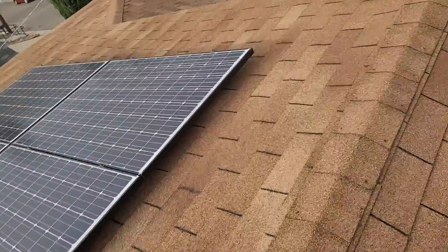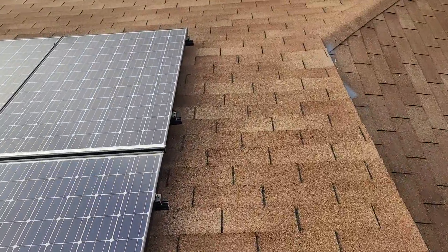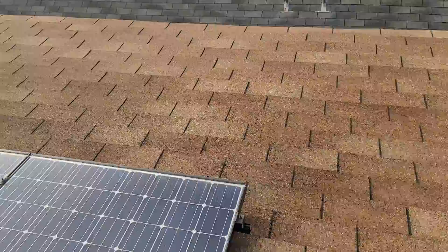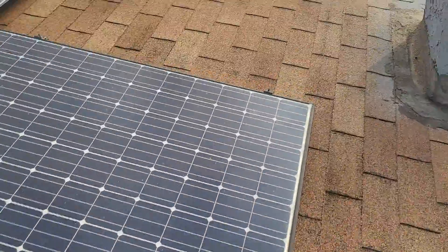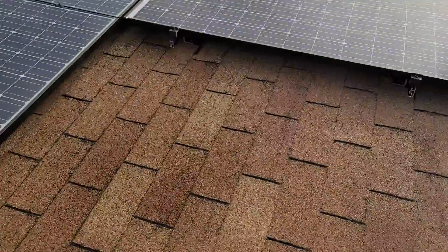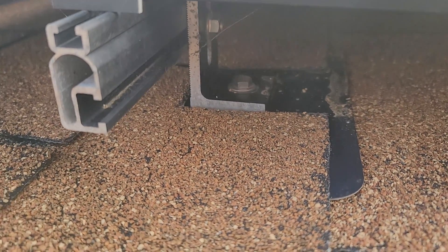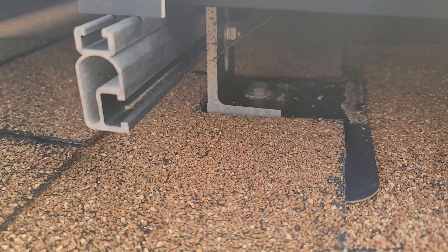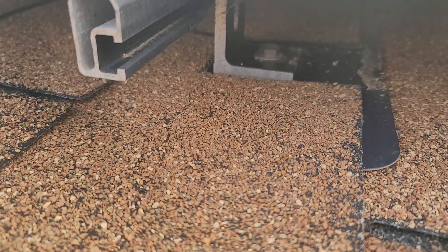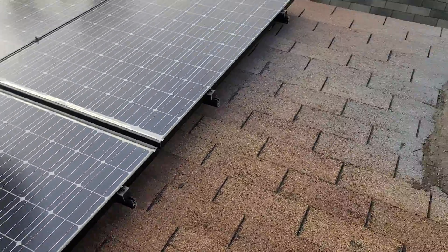It is very typical — the older these shingles get the faster the granules come off. I would not put any blame for this leak onto the solar installation. We get a good view here of a little extra detail on each standoff: trimming the shingle and having the standoff flashing tuck up higher into the shingle — that's a nice detail. I've got to hand it to them, this definitely looks professional.